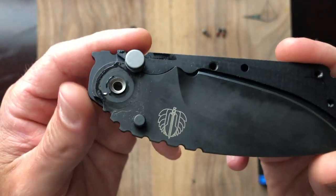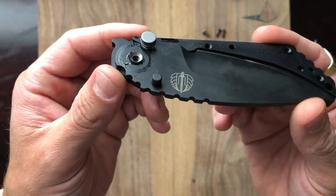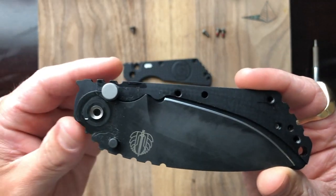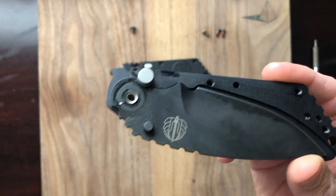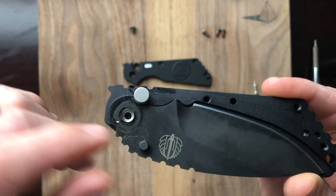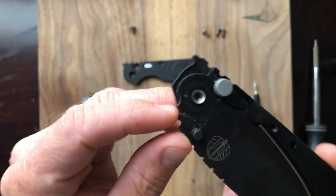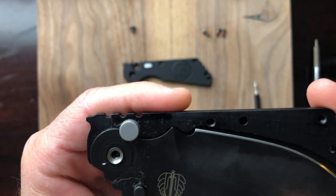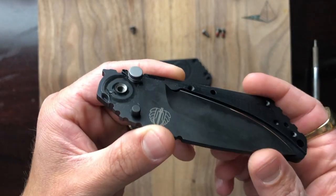This is on a coil spring, and when you click that button — which I'm not going to do right now because the blade would fly off — that's what allows the blade to deploy with that snappy automatic action. That coil spring is basically storing up energy, and as soon as you click that button, it releases and fires the blade. The button doubles as a lock, so when the blade is in the open position, the button itself is locked up in this circular depression, holding the blade open. When you want to close it, you press the button down again and close the blade. It's a very straightforward design.